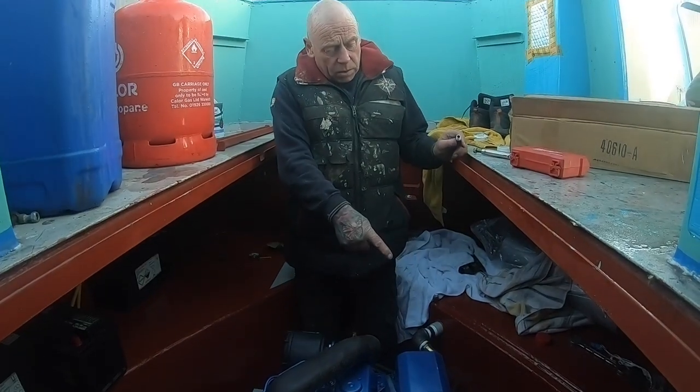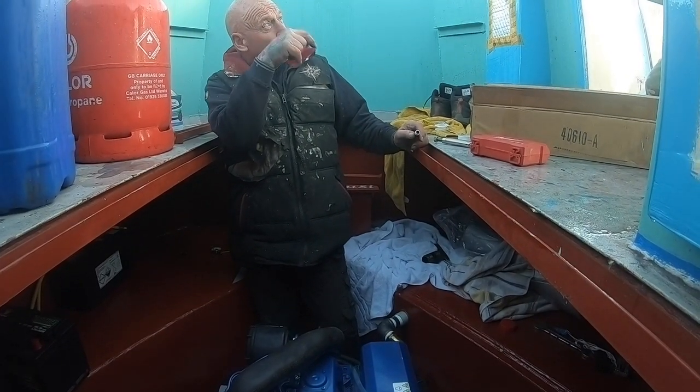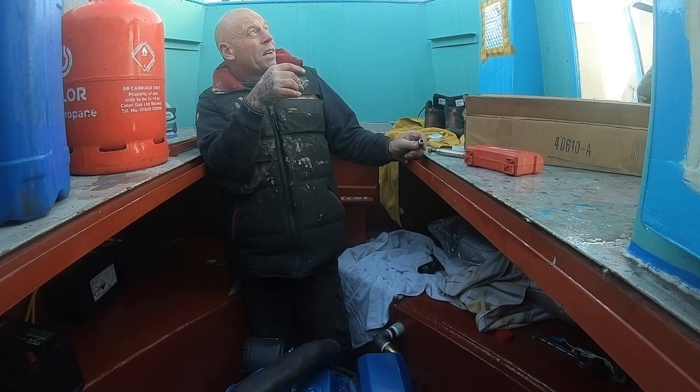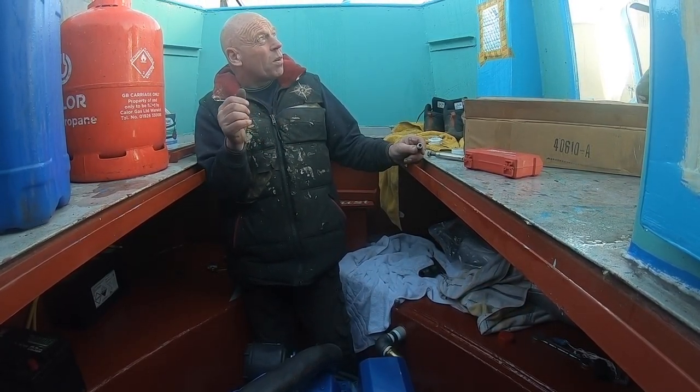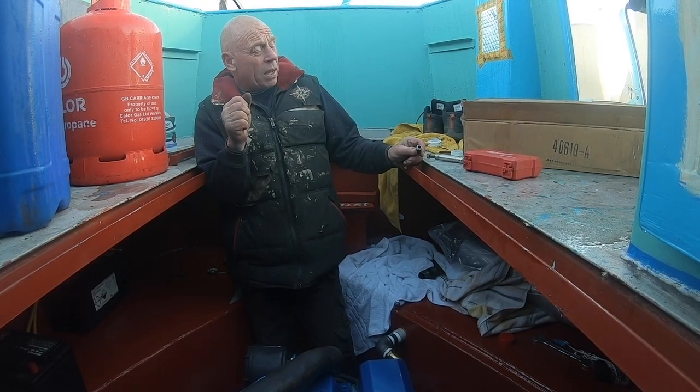I was saying to H, sometimes in the sockets on the tank, it gets a blob of weld inside. So when you put your PTFE, it chews it all off, and then it leaks. But if you use a liquid PTFE, it sets so hard you can't turn it. Nightmare to get them back out if it leaks.